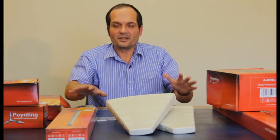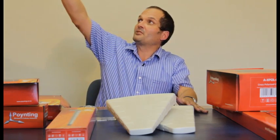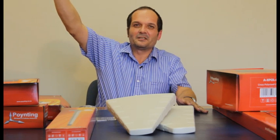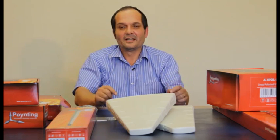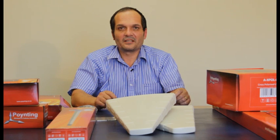That's how you can do it with separate antennas. By the way, even with DAS systems mounted against the roof, you can put two systems in, but that starts looking a little ugly. So we are currently developing a DAS antenna that will actually have two inputs, so you don't have to put two separate antennas for every access point in a building.